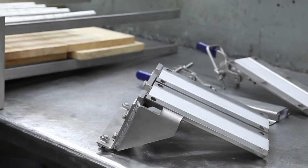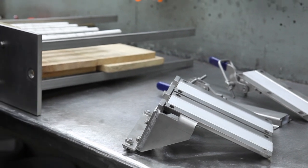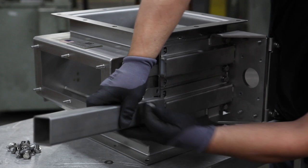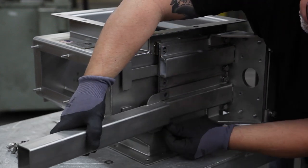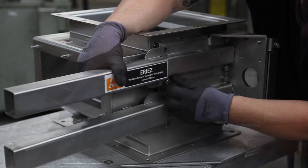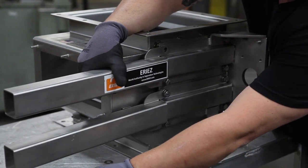Put the new white sliders inside the new side brackets and cylinder mounts, then bolt to the side of the housing with the 3/8 bolts again. Remember to bolt the slide guards with the rear bolts of the side plates. Repeat this for both sides.